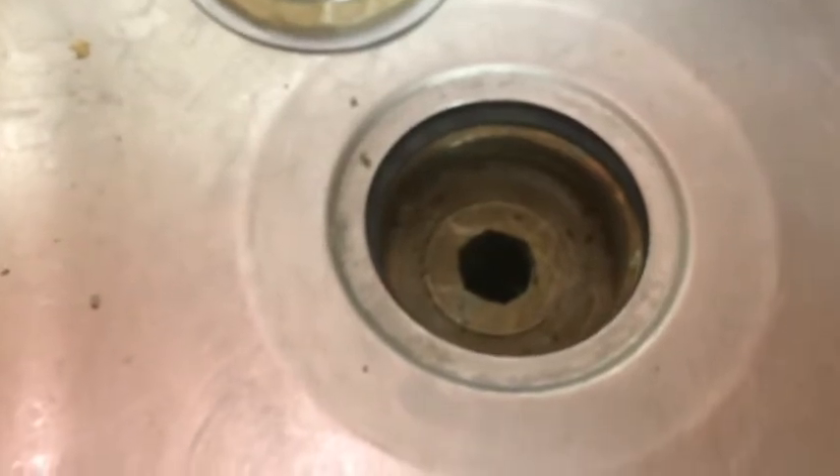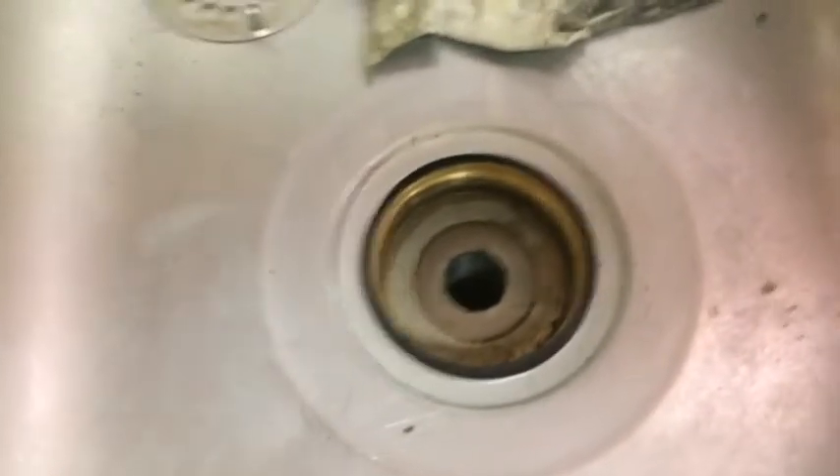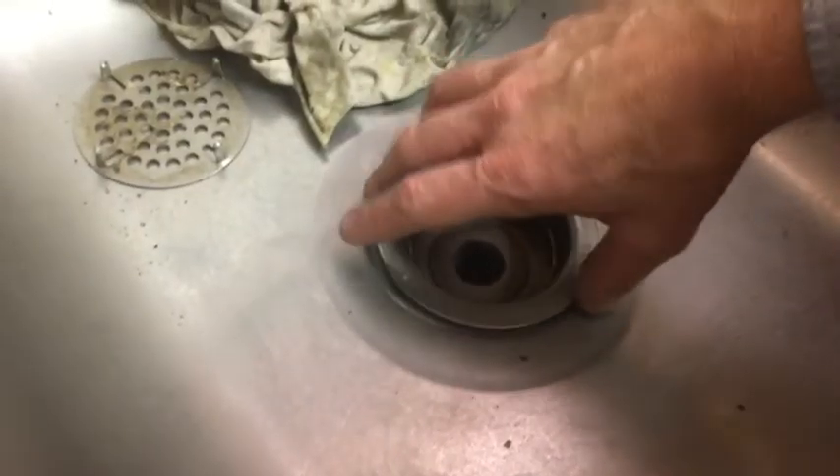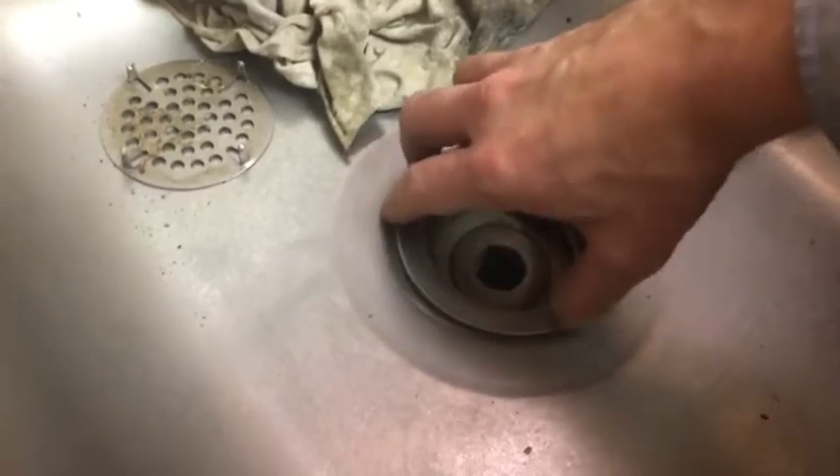Got all the new gaskets in. I'm going to fit these together all at once. This is a nice Fisher drain — the good one. Got this flange with the putty all ready to go. This should be lining up a little bit straighter. I can cheat the pipe that way a little bit — push one hand and then put the flange in with the other. I can wiggle the drain around a little bit underneath the sink to get these to line up. They should go pretty easy. That just goes nice.